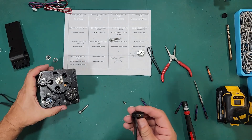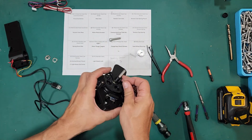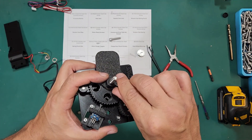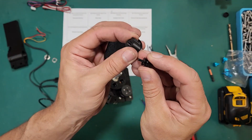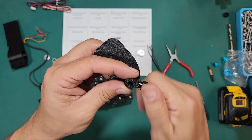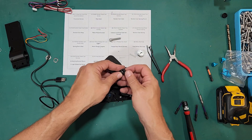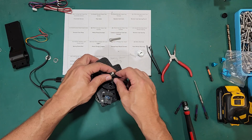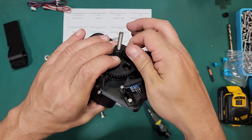You can use the M3 by 8 screw included in the kit. For my builds I like to use thumb screws — you can buy aluminum thumb screws from AliExpress or Amazon and they just make your build a lot nicer and cleaner. Unfortunately those weren't included in the kit as I couldn't get a good deal on them in bulk. For this build I'm going to go ahead and use one though. You don't really need to tighten these down very hard — it's just to keep it from sliding up that axle, so just finger tight is good enough.